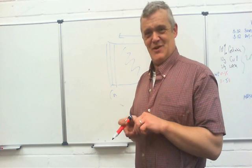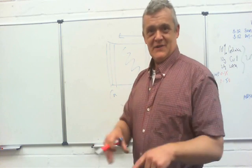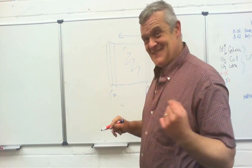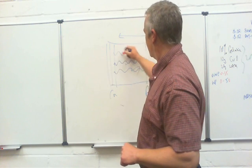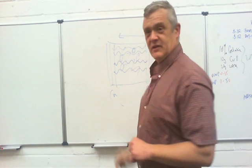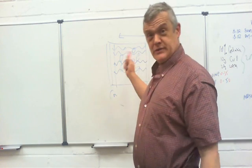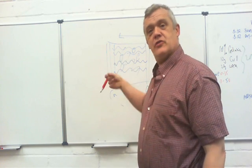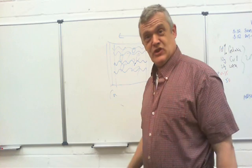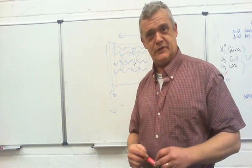And I was thinking, hang on — I've got a bucket load of graphene. Let's chuck some graphene in there. And that's exactly what I did. So I took the active material, added five percent graphene, whipped it all up with a household blender and painted it on the bit of plastic. The idea is that the graphene forms a whole load of connected wires between the two electrodes with the active material sitting on those connecting wires. Effectively we've taken that flat panel, swapped it around and spread it out — we've still got lots of little wires in there with our photo-active material connected to them. And we all know how quickly graphene transports things. So when sunlight hits that surface the electron can be whizzed off along the graphene to the current collector, and because the current collectors are different work functions, it can only go one way.